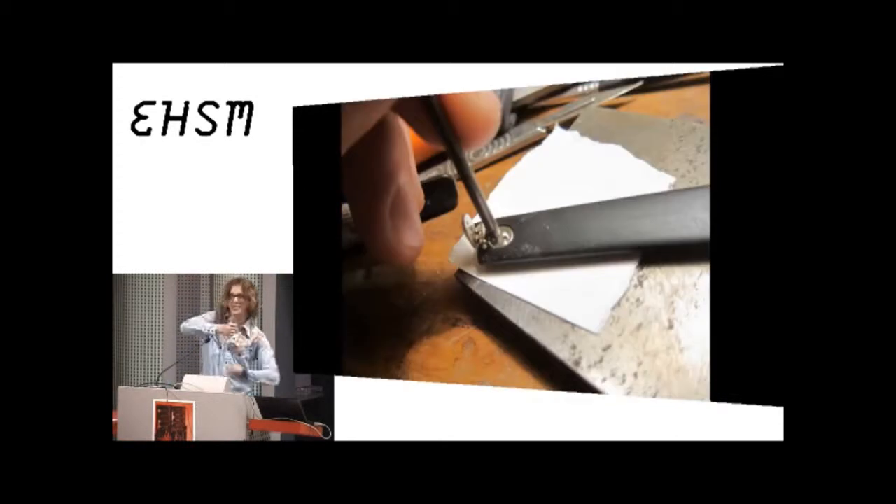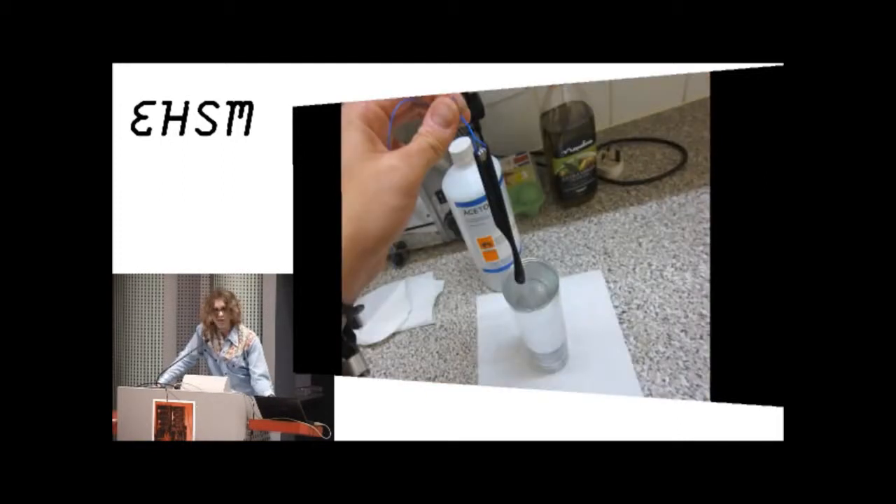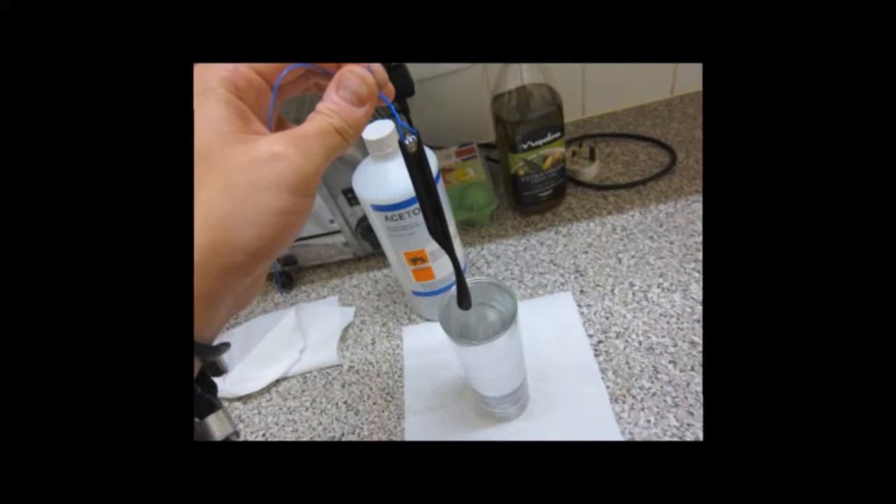You put the rivet in from the bottom, put the hinge on from the top, hammer it with your punch, and you end up with something nice and strong and sturdy. To polish the surface: this plastic can actually dissolve slowly enough — and fast enough — that you can polish it just by dipping it into acetone. It's a terrifying experience after spending an hour making a beautiful bit of plastic, then dunking it in. But if you just dip it for a few seconds and pull it out, it comes out with a mirror finish. That saved me a lot of time — I learned about it by going to this glasses manufacturer, and this old guy of about 80 years old who ran the company told me this technique.